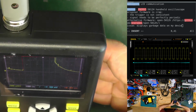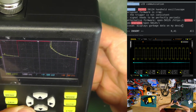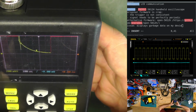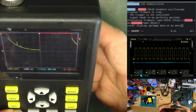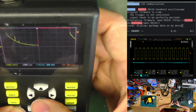You cannot configure 10 time probes, which is really a shame because 1 time probes distort the signal. 50% button doesn't work. At least this works. So setting the trigger point works, and the trigger works well.